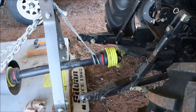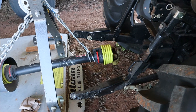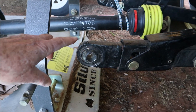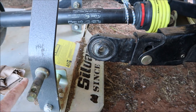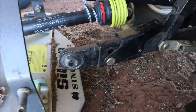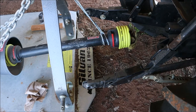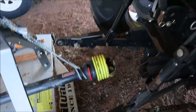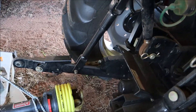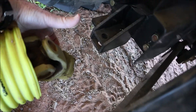To attach it, you reverse your tractor up to your implement. I normally set the tractor's attachment a little bit higher than the implement's attachment, then reverse up and try to get the tractor square and in line with the implement. You attach the two lower linkages first, then move on to the top linkage, and once all three linkages are in place you attach the drive shaft.